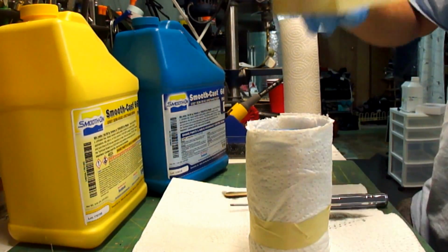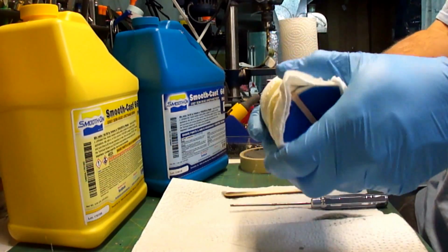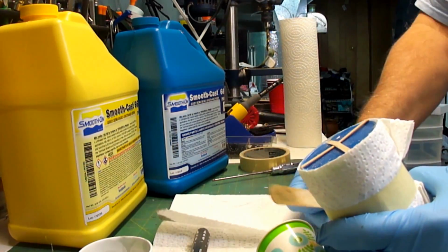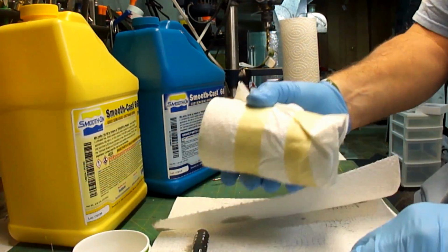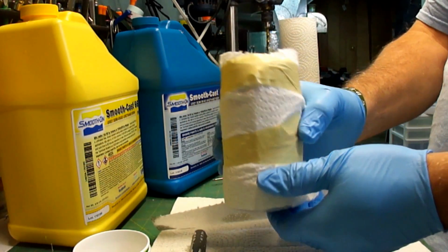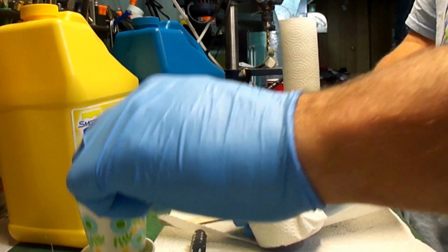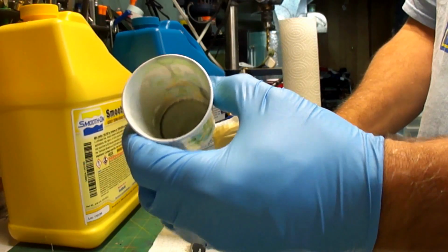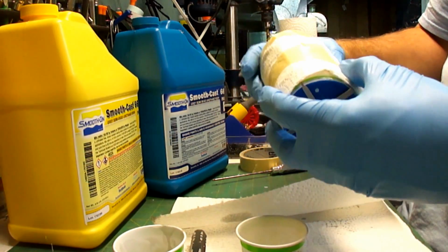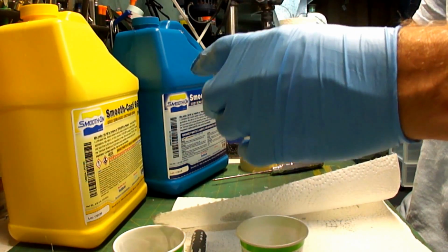Now this particular plastic has a pot time of about 7 minutes. So yeah, as usual, I'm quite good at making a mess. All I'm going to do is just slowly start turning it. I need to do this for a good 10 or 15 minutes. There's a little bit of the plastic inside. I can keep an eye on that also, just to give me a rough idea how it's doing. Little turn every time I flip it.